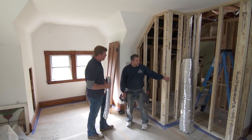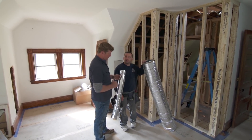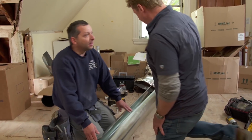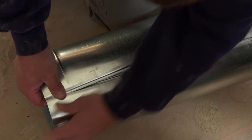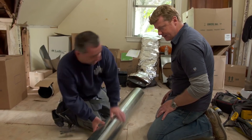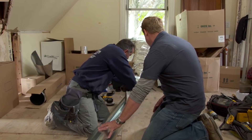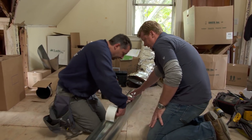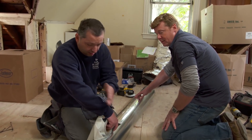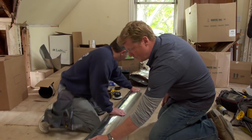Aren't there rules on how far you can go? It's better to run the plenum — more plenum than attenuator — so you can run something this size all the way around, no problem, and keep the attenuator runs short into the rooms. This is the main supply line — a 7-inch plenum — and the size of the pipe is determined by the size of the air handler. The sections just snap together and then we seal them with seal tape — the real duct tape — so the connections never come apart and don't leak. At high velocity there's so much pressure we don't want any leakage at all.